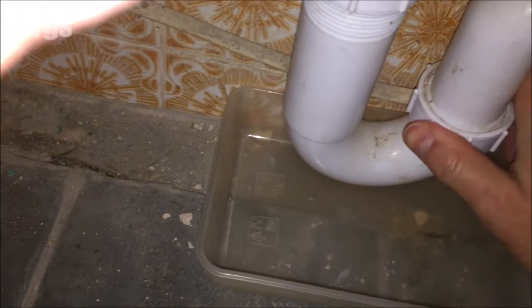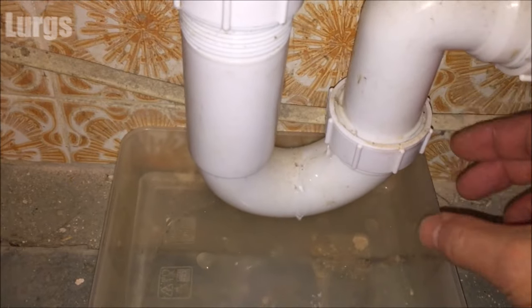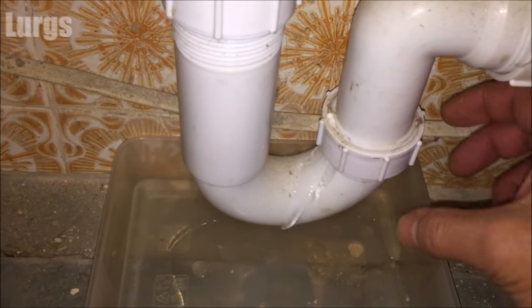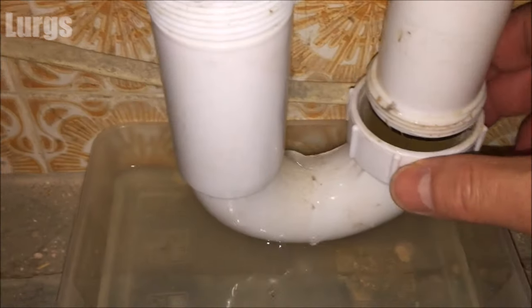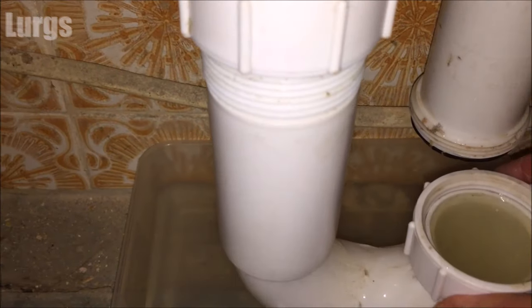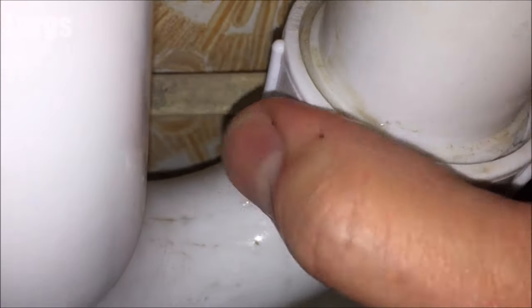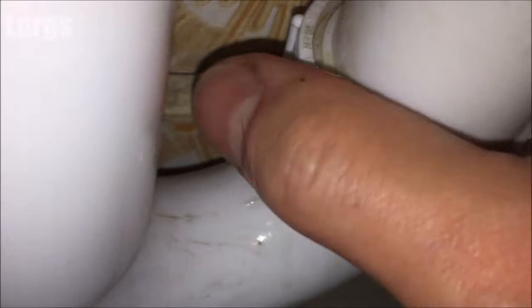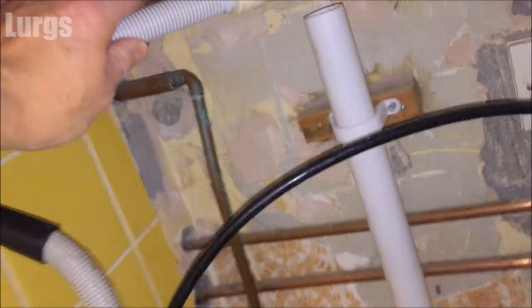These shouldn't be done up very tight unless somebody's glued them. What we're hoping to see here is just fresh water — you'll soon find out if it's blocked up with gunge and gunk. This one's looking pretty good; it's meant to have water in there as it sits in the U-bend. No blockages, so just tighten it all back up. Don't use any pliers — just hand tighten it, as it's only a plastic thread and you don't want to damage it. Then put the drainage hose back in from the washing machine.